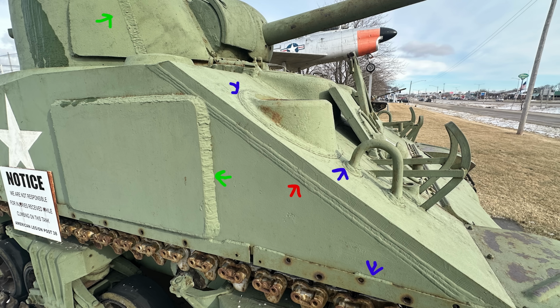On the top of the machine and numerous other places, they had big, wide, 2 to 3 inch wide subarc passes, and I'm not exactly sure why here they would have done it as a set of stringers instead of a single one, because no doubt they could have done that in one shot where the bead would be that wide. Maybe it was some issue with the joint style where they just, I don't know, maybe they'd melt over the corner. Not really sure why they did it that way, but that definitely is not stick welded.